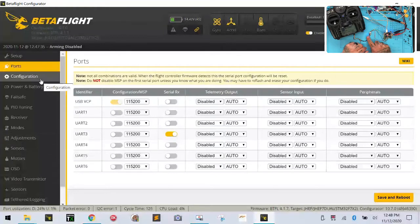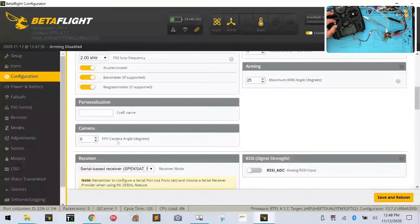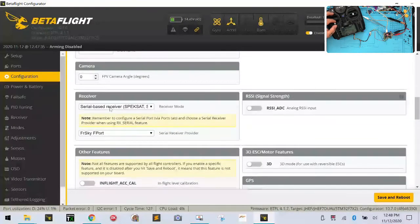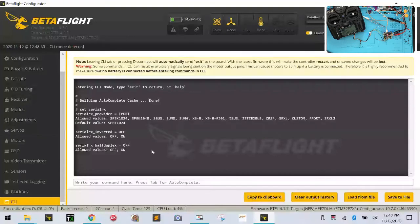I didn't have it set right apparently. The blue light's back on. I guess it turned off by default. So on my configuration, I'm in FrSky, I'm on F port, I'm on TX3. I have no signal going across so far. So now I'm going to go to the CLI. I'm going to type serial, then set serial rx underscore — so it's set for F port. We're going to check inverted and half-duplex.